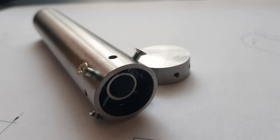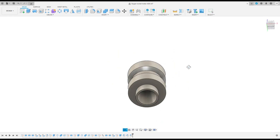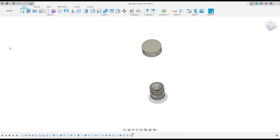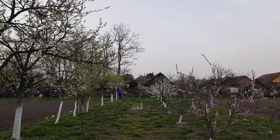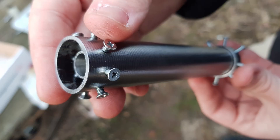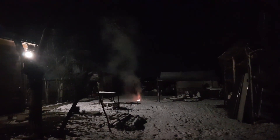So the engine is really just a tube with two ends: the cap that does nothing aside from some boring stuff, and the nozzle which accelerates the burning gases to over 1 km per second. As you can imagine, the pressure required for such a speed is enormous. I can't give you an exact number because the engine ended up making double the thrust it was designed for, but I would say the pressure inside the engine is about 30 bar. The engine only sustains that for about 1 second, so it isn't really that bad.